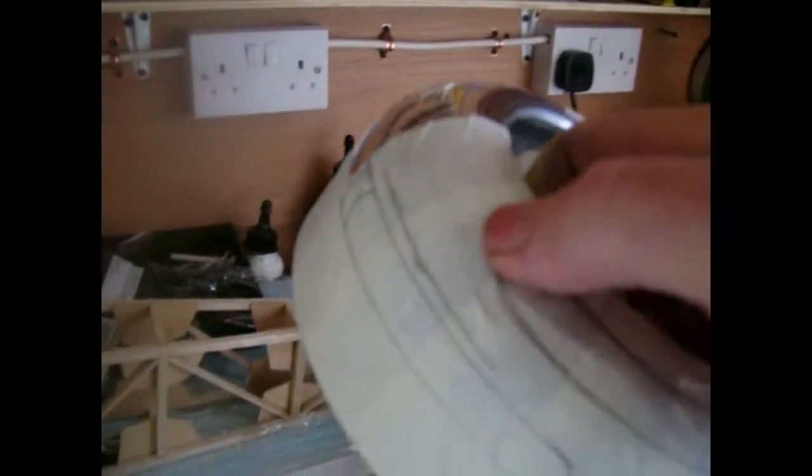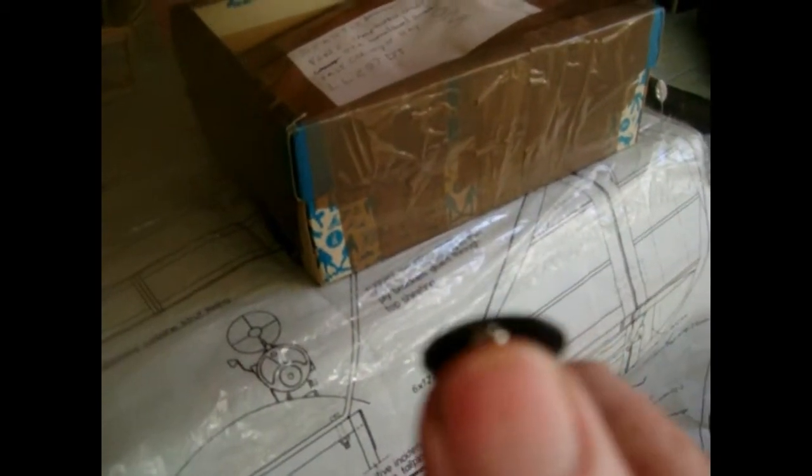And then after you've got it marked out and you're happy with it, you use your Dremel with your little cutting blade. I keep the smaller ones, because the smaller they get, the better for doing the little corners here. So start with the big one, and then you go around the outline of it. The reason it's marked is, one, it's easy to mark, and two, it holds the cut for you, so you don't slip off the shiny steel.